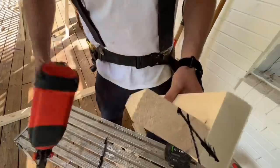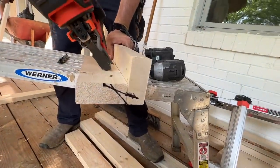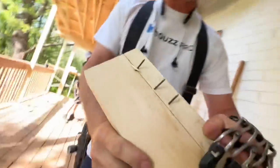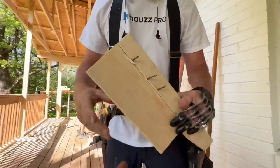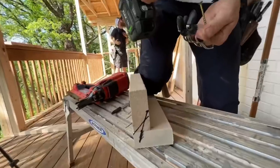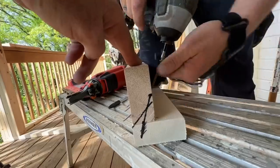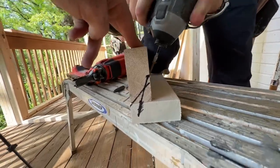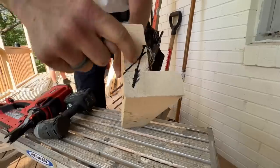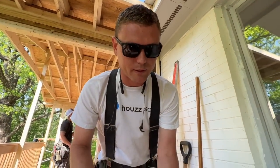That's like the pocket screw kind of thing. If you take your nail gun and try to toenail it, you get it nailed, you come around the corner, the boss man says 'that's great' — but that's nothing. A typical toenail is about 45 degrees and you miss out the back. The toe screw at a steep angle is the right move. Start it in, go steep — it did tip out the back just a tiny bit, so I should have gone steeper. I've seen a lot of nails up the back of boards like that — you think it's good but it's not.